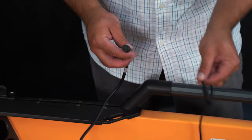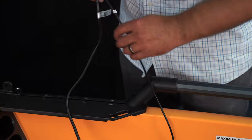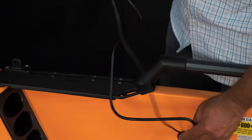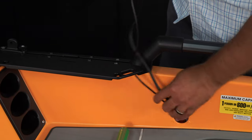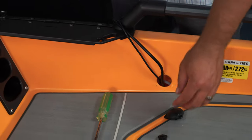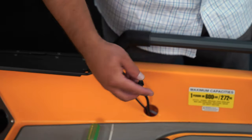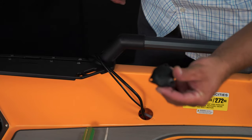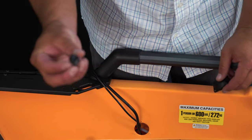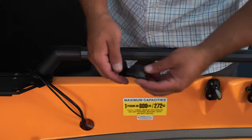We've got our power cable that we just finished setting up and the transducer cable exiting the opening here for the three-way plug. And you've got rubber grommets included in the small parts kit with your kayak, like we mentioned before. You can do two separate wire fittings around these cables where they exit through the through-hole plug here, but I'm choosing one that's got two openings in it that can accommodate both plugs, just to keep things a little cleaner.